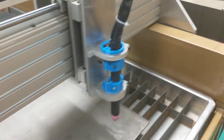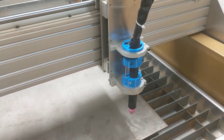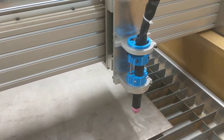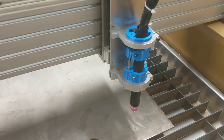The torch I'm using is a Lotus — it's a high-frequency torch. People do have issues with the high frequencies; it tripped my limit switches which I use on the mill, so I've disengaged them for plasma cutting. I cut some squares the other day without the Proma and it didn't seem to cause a fuss with the limit switches turned off.